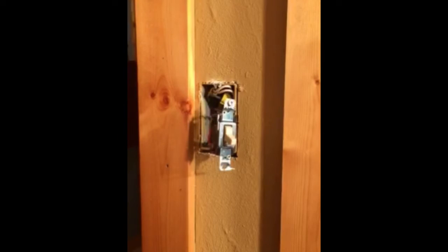So if we show power on the top lug and the lights are off, we know this is our accessory switch. It's very important to make sure the lights are off when we test for power. Now we'll flip the breaker back off and start changing out the switch.